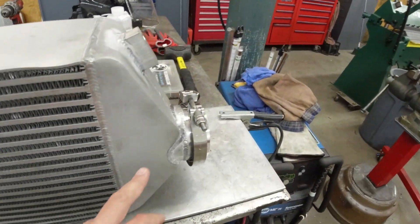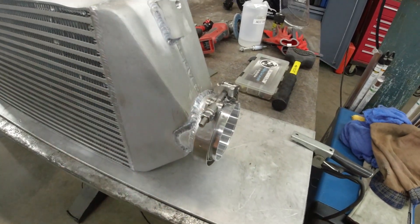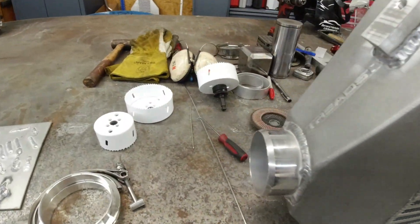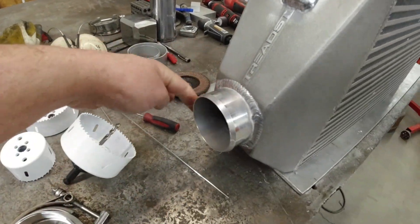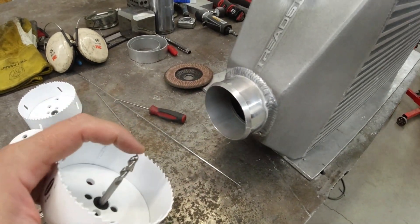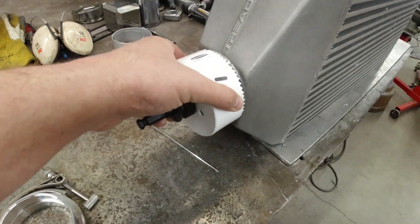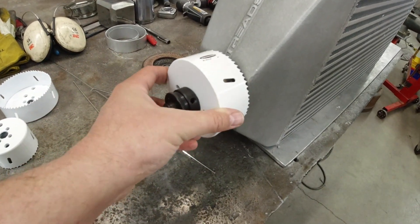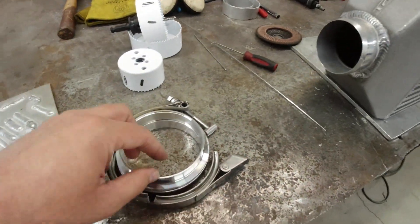With this side, it was kind of archaic when I was cutting it out — I just put the tube up there, marked it with a marker, and started making little slits and cutting it. But this side I'm going to go with a hole saw. So we'll hack this off, then weld in a slug so we'll have something for the arbor to go into to keep it straight. Because if you didn't have something to keep it, it just kind of whips all over the place. So once we get that in there, we'll saw that — should be a nice cut.